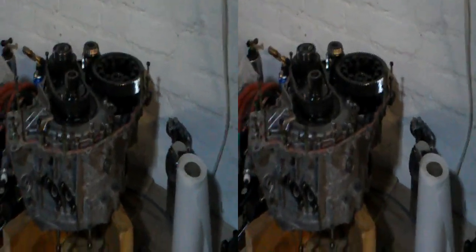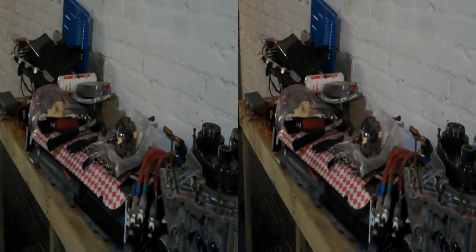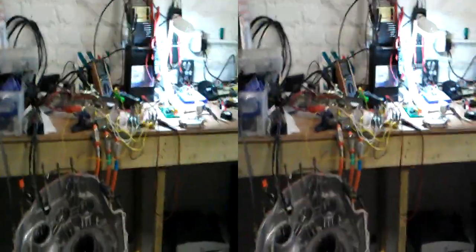All those gears will obviously be stripped away again. I'm not quite sure how I'm going to get the differential out, but it has to come out somehow. That gives us the power, which means we can experiment with this instead of just having it running on a 12-volt battery — we can actually increase the voltage and control it. As it draws more power it will slow the engine down, which reduces the voltage, giving us a bit of a fail-safe. And obviously if things start to get nasty we can always kill the engine and that stops the power.